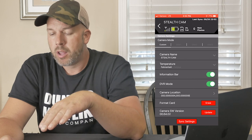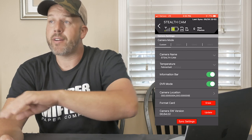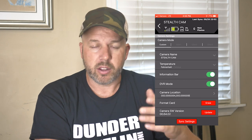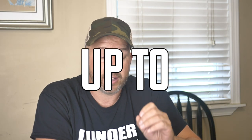When you have DVR mode turned on, when your card fills up and you take a new picture it's going to write that file over the oldest file on your card. If you don't want that to happen you can just turn DVR mode off and go out and change your card. You can also always format your card. This takes a 64-gigabyte card — I don't know if it'll take bigger, but it takes at least 64GB. Right now I have a 64GB card in it with at least 500 images and it's only three or four percent full.